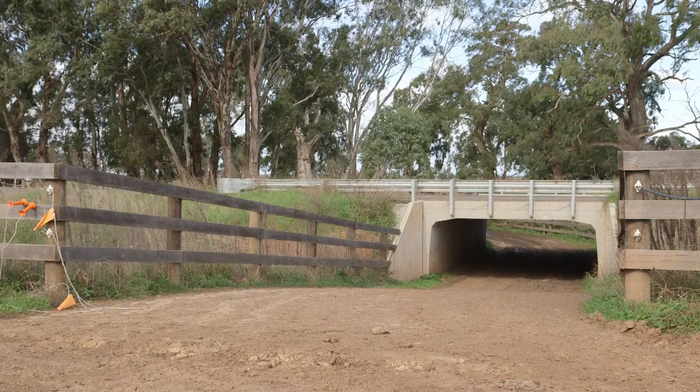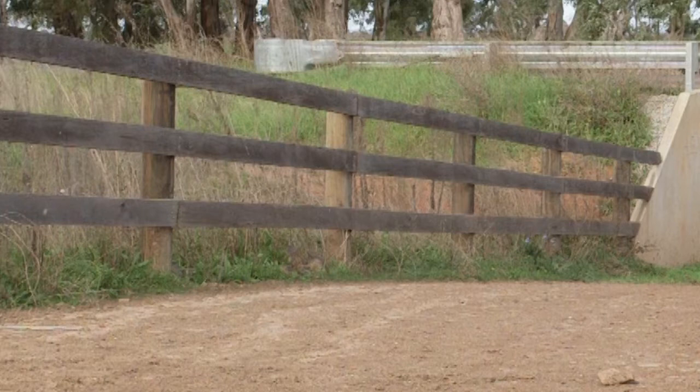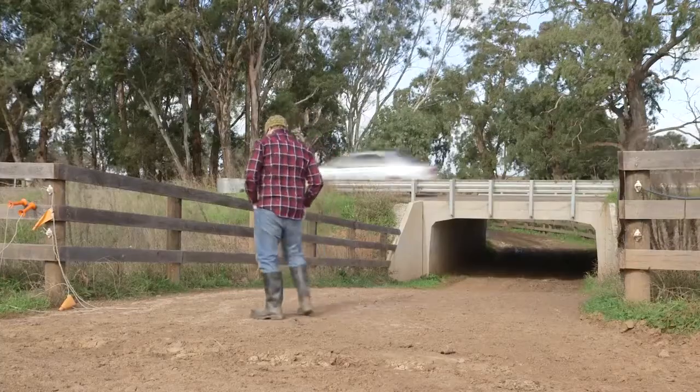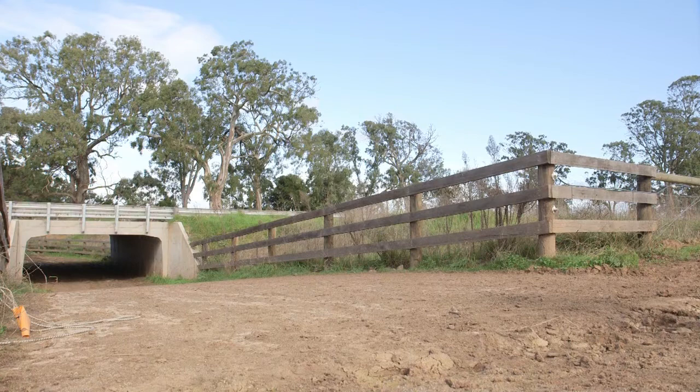Underpasses are likely to be problem areas also. The main problem is gravel rolling down to the lowest point. The gravel could have been carried down off the laneway approaches or have fallen down from the sides of the cutting. To solve this problem, lay concrete from the underpass right up to the top of the slope on both sides. Gravel from the banks can be stopped from rolling onto the concrete surface with sandbags along each side of the laneway or by concreting the banks themselves.